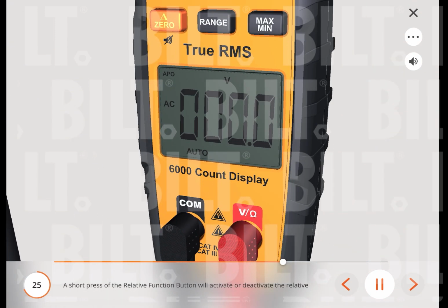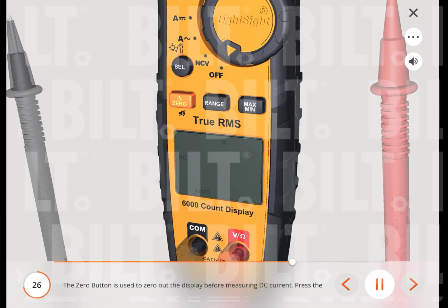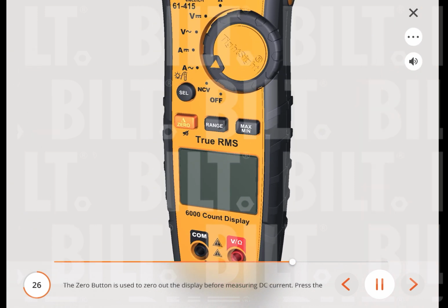A short press of the relative function button will activate or deactivate the relative function. The relative symbol is displayed, and the value on the display is stored as a reference value. In the relative mode, the value shown on the display is always the difference between the stored reference value and the present reading. The zero button is used to zero out the display before measuring DC current.